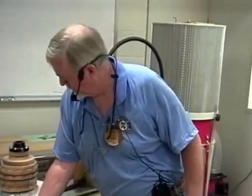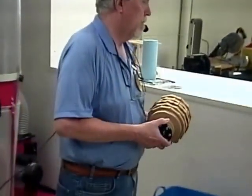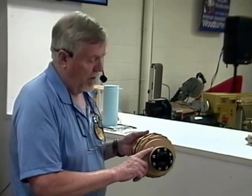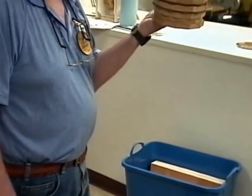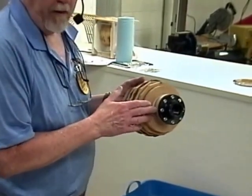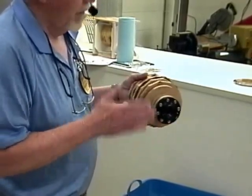One other question that comes up once in a while is, well, what about your chuck? I don't use a chuck on any segmenting project. Very rarely would I ever use a chuck on them. Face plates are relatively cheap. I bought a couple of aluminum face plates, and I've got a couple that I bought with my lathe. So what I do is I attach a face plate to a waste block, and you'll notice that there's a line on the waste block, on the glue block here. That's so I know how deep the screws are in the face plate. I don't know how many times I've used this face plate, but when I get down close to that line, I'll part that off close to the line and glue another waste block on in front of it so it gets longer again. And then I just keep going down.